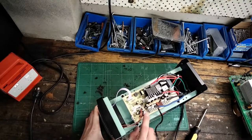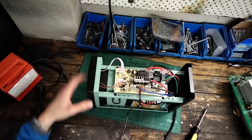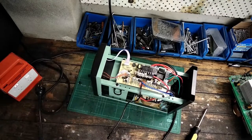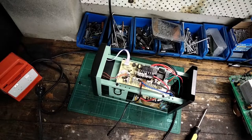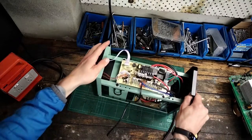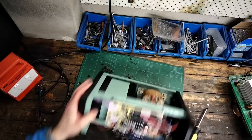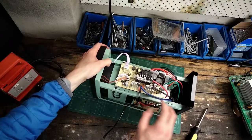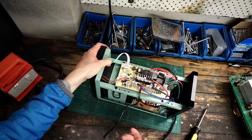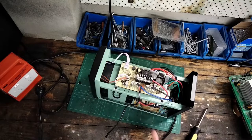I can see some sort of MOSFET here — I suspect that's the charging MOSFET. They're generally smaller and just sit there heating up a little bit while charging the batteries, burning off some excess energy. Although that really depends on the design, because sometimes these systems use the H-bridge since each MOSFET has a diode in it. When you're providing power back into the H-bridge, it actually becomes a full bridge rectifier, which can be used to charge the batteries directly back through.